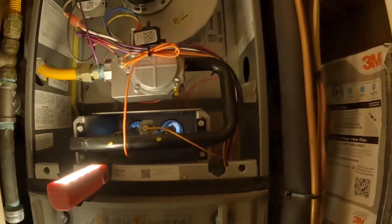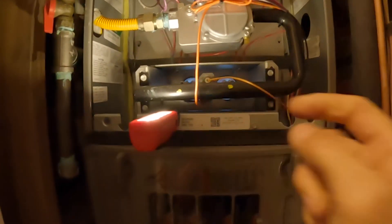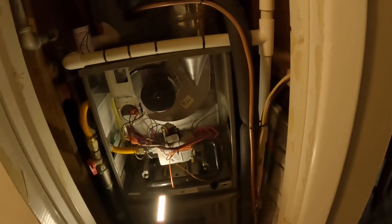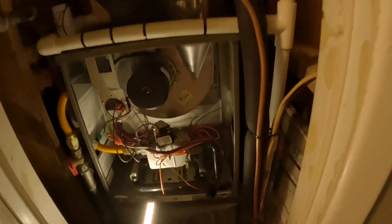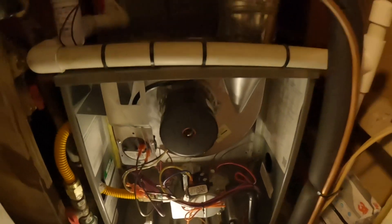I am not seeing a fault right now. The filter is in backwards. The way it lit up, I'm thinking I'm going to cycle it off. I kind of suspect there may have been some air in the lines — like maybe the gas was just turned on. It does that sometimes when you first turn them on and it's got to get full pressure. Sometimes it's the gas, not the crossover. I'm going to watch it again, let this cycle off, and light it up one more time. It has fully cycled off, so let's turn it up.